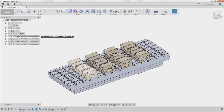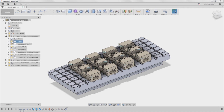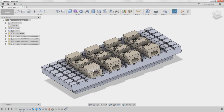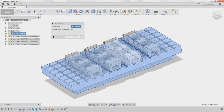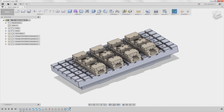There we go. Turn off my joint light bulb — I don't want to see them. Now there's one problem: the first vice is perfect, the body doesn't move, the jaws do move. But the second and third vice — the whole thing moves even though I created that pattern. So the best way to solve this is to do another assemble rigid group. I can click the body of the table, then click vices 1, 2, 3 all at once. Now I've got independent jaws that move correctly but my bodies are secure.